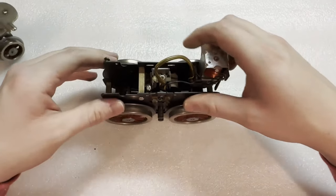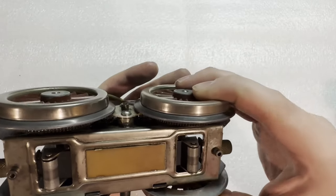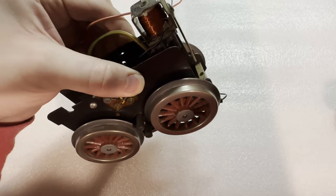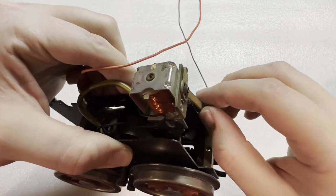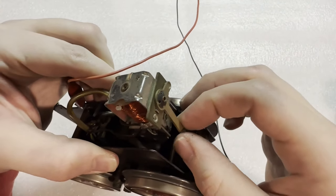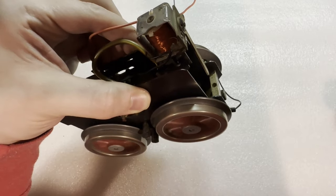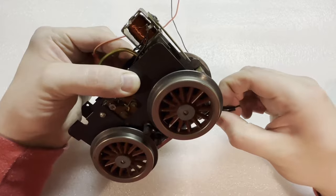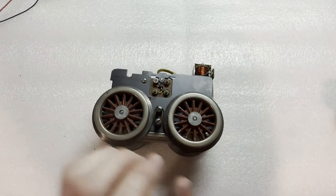Anyway, let's see if this motor is working. Just looking around it, the grease on there still looks fresh and wet, so I'm not sure if I even need to re-grease it. It keeps working, and so does the reverse unit. And it looks like the on-off switch for the reverse unit works just fine too. It's actually working pretty well. I'll still give it some cleanups though - make sure the bearings have fresh oil wherever they need, clean up the commutator a bit, just standard stuff.